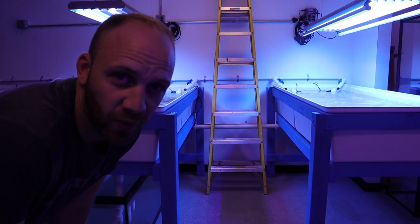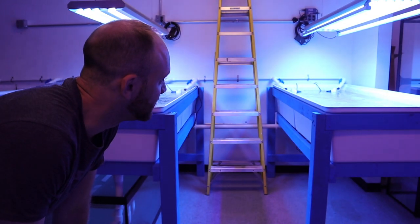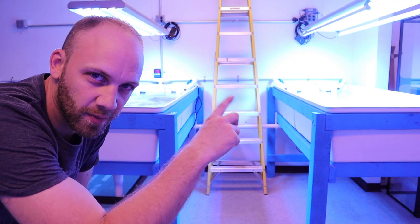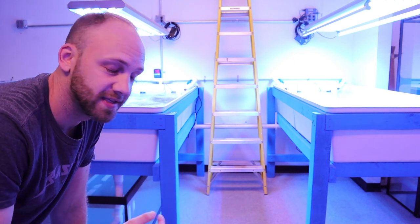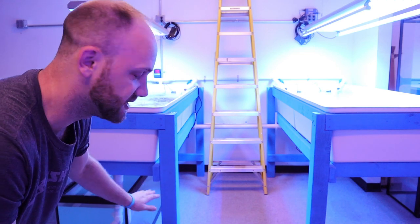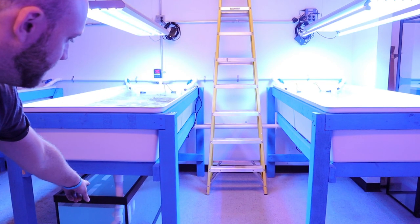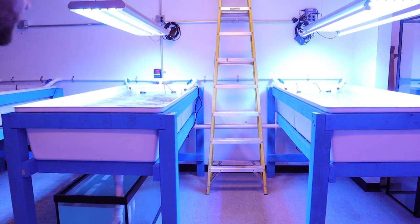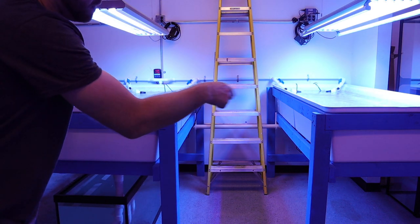Yeah, probably. What's also very important here, this is the first time we're doing this power outage test. Basically, right now the pump is not plugged in. Every tub is draining the remaining water out from when we moved those little elbows, and the sump is now full with the water change water. When we plug this back in, it's going to determine where this sump running height is. As long as it's not too far below this water line, a couple inches of room still, and we don't have to add too much more water, it should be right on. So in case this place ever loses power, that sump won't overflow with all the water from 3 different vats.